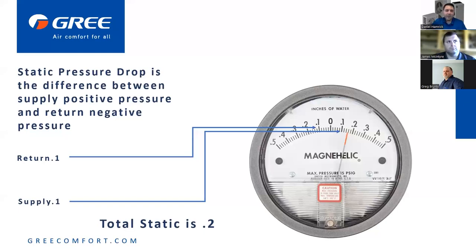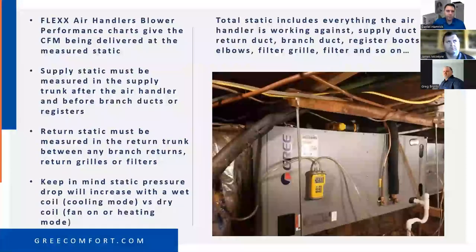It's important to note where the decimal point is. The A-revision air handler is rated to 0.4 inches of static; the B-revision air handler is rated to 1.0 inch of static. This is a significant difference in blower capabilities. Both should work just fine as long as ductwork is sized properly and the fan is set up correctly.